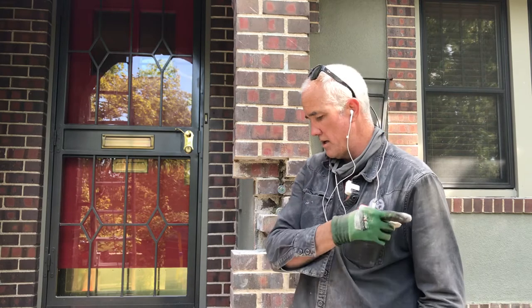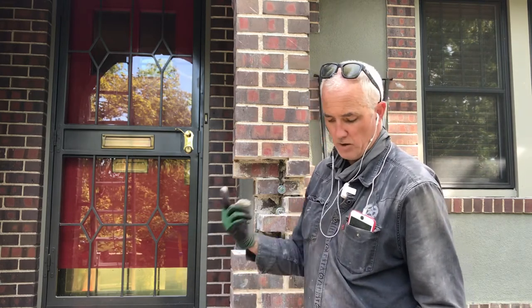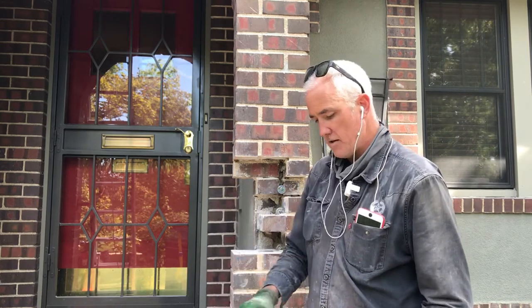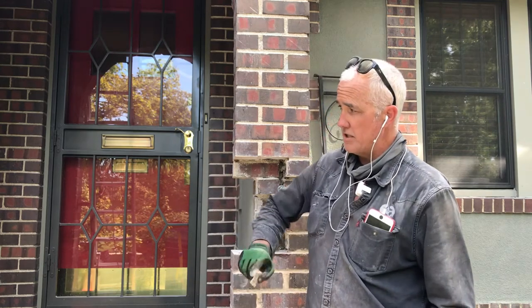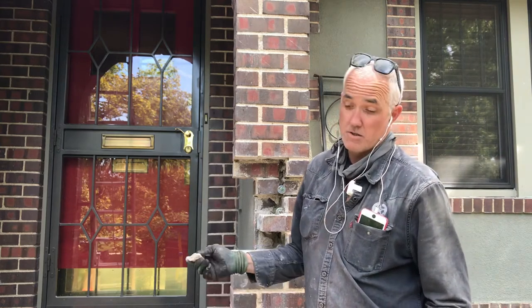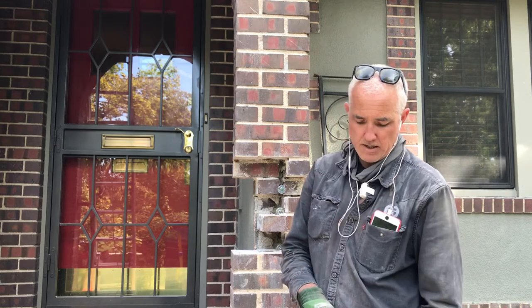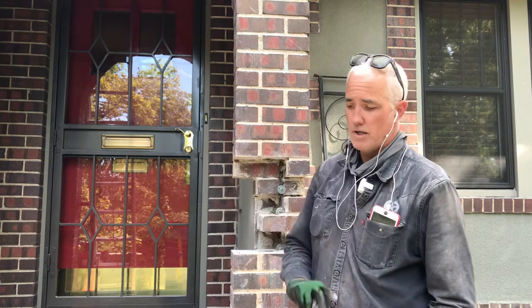So I took one bucket and I mixed it into a full mix of just regular white mix. And now I already know that's going to cut the white down. It's going to knock the edge out of that white. And what I've got to do is increase the beige kind of tone to it. So I took more light buff. I think I went with maybe a half a cup or even as much as a cup of light buff to get it to here. I've dried this out. We've put it on the wall, and you can't even see it.